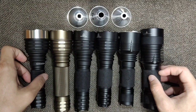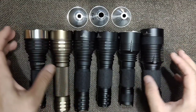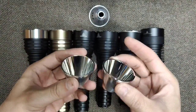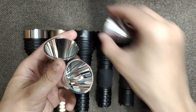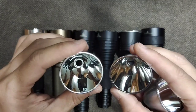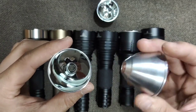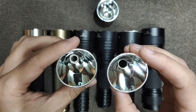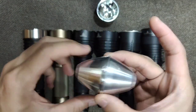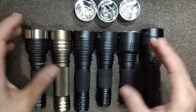Let's talk about the CX series flashlights. They are called the CX series because they are very similar in reflector size — quite similar, maybe even the same reflector size, so they can use the same reflector. The difference is just the hole size — about 7 or 5 millimeters, or about 10 millimeters for the XHP 70.2, and some have 9 millimeter holes. The difference depends on the emitter you use.